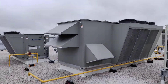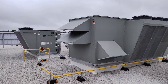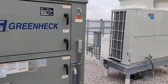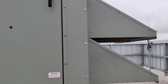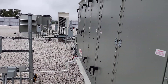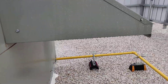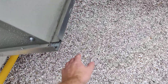Back here on another roof today checking out some new rooftop equipment. These are Greenheck DOAS units, or energy recovery units. Basically what they do is they're designed to take in large amounts of outside air through these hoods, then first temper it, dehumidify it, and then bring it into the building. Then the cycle repeats and exhausts a lot of the air out to the side.